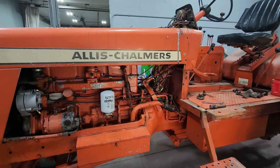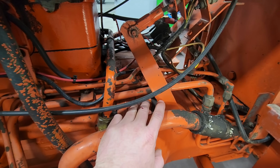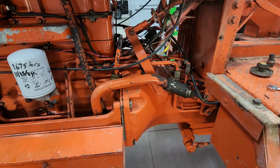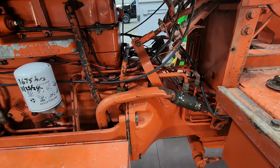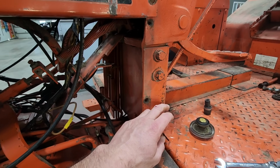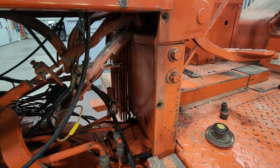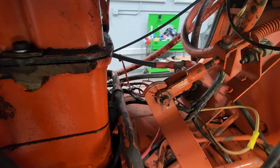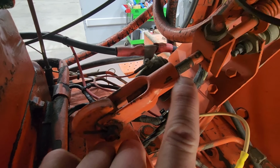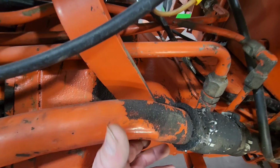All right, it's the next day. Have it over here in the paint shop. I'm afraid that this one's gonna get a little bit deeper than a paint job already, but yeah, that's the way it goes. The clutch, even when you have it down all the way, sometimes it's kind of hard to get it into gear. Like there's not hardly any free play left, and this has been adjusted. I mean, there's still more adjustment, but it's been adjusted a lot. That's not what concerns me.